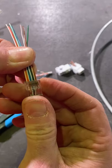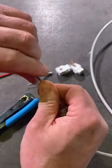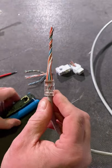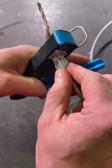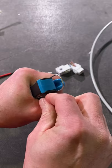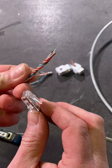Here's the top tip: once you've checked it, twist it — twist really firmly. In a minute you're going to find you're picking up one item instead of eight individual conductors. Introduce our FT45 crimping tool from Ideal Industries, through it goes, squeeze nice and firmly, and there you go — one item to pick up instead of eight. There's a top tip from efix.